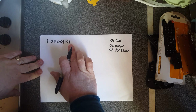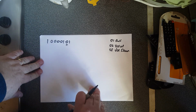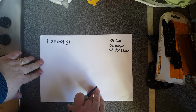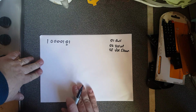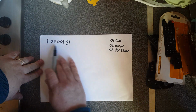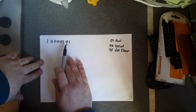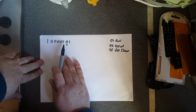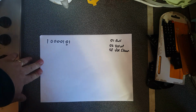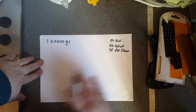Now the problem is, actually I tell you, this symbol here in the Philips RC5 protocol, I believe, and I'm willing to stand corrected on this, is a flip bit. So although you can only have up to 65 codes, if you've got more buttons on the remote, you can set that to 1, and that effectively restarts this at 66 upwards. So you can have 128 buttons on the remote, but we'll ignore that for now.